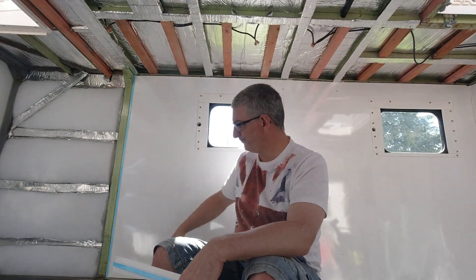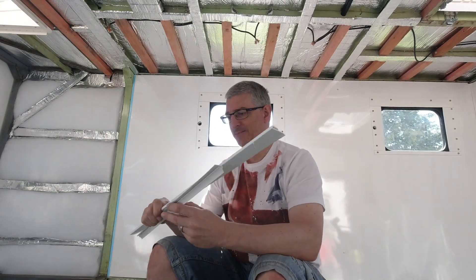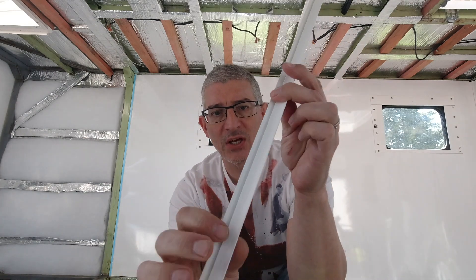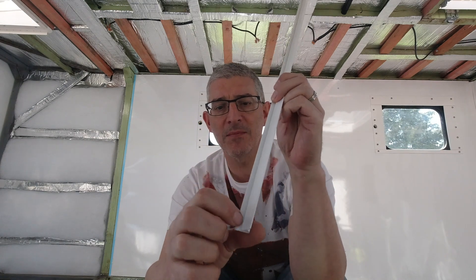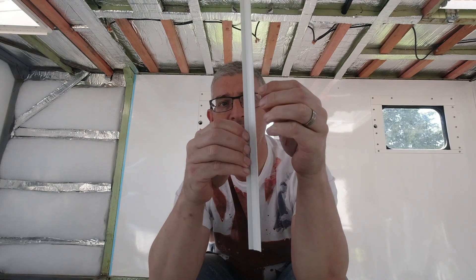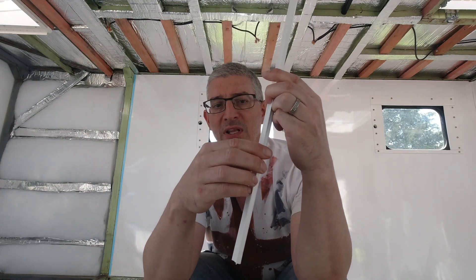So I looked at lots of different ways of getting these panels in, and I didn't want tons and tons of rivets going all the way around the edge. I wanted something a bit cleaner and I found these. This is one to go into a corner — you can see it's rounded off and there's just enough room to rivet through here with really small rivets, and then that will track one board here and one board under there.